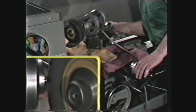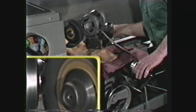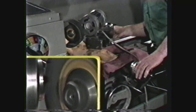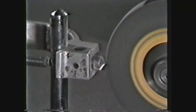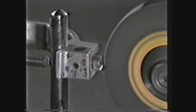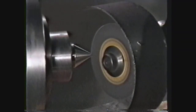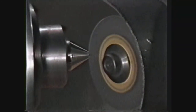The rate at which the compound is fed across the surface of the workpiece will greatly affect the surface finish. If the grinding wheel is fed too fast in the roughing operation, the wheel may load and cause burning on the center. A loaded grinding wheel must be redressed before it can properly take the finishing cuts on the lathe center. A light pass of one quarter to one half thousandth is usually sufficient to give a fine finish.